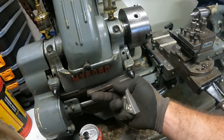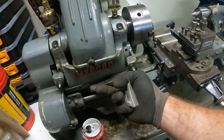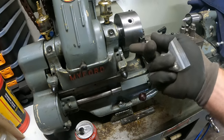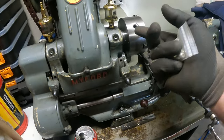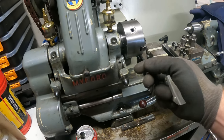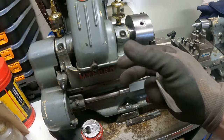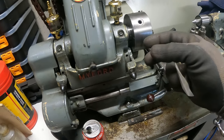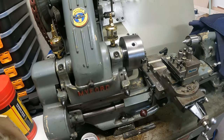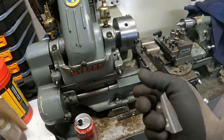And then on top, put that rusty old round stock off the film set, with a through hole, and thread a bar that will go through it. So I'll have to drill a through hole. I'll do that on the lathe as well as cleaning it up, and have the hole bigger than the threaded bar, so the threaded bar could slide through with ease, and then have your stopping nuts, which should be knurled nuts both sides, just to stop it off. Seen it on one of the guys that I'm subscribed to. I'll just look into ideas really how to do this, and I'll do a similar sort of thing.